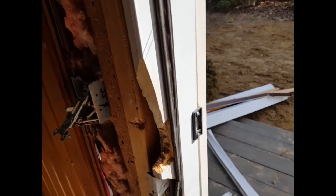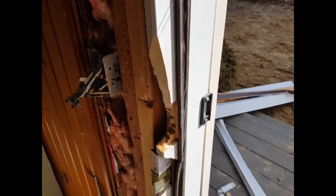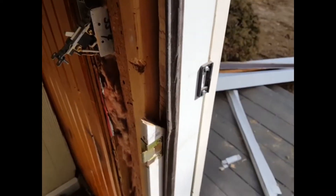I'm just going to glue it and pin it, and it should be a good repair. I've cut it out and done a dry fit with a piece of 1x4 — I'll leave it long for now. As you can see, I've 45'd the opposite sides so it's a nice tight fit. I'm going to glue it and clamp it, then cut the excess off, sand it up, and we should be good.